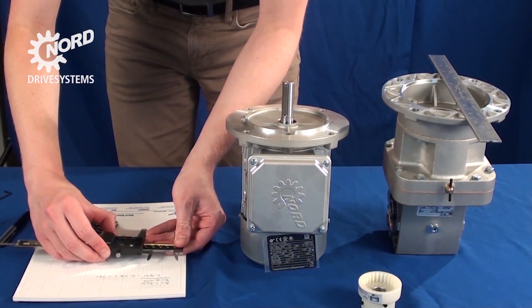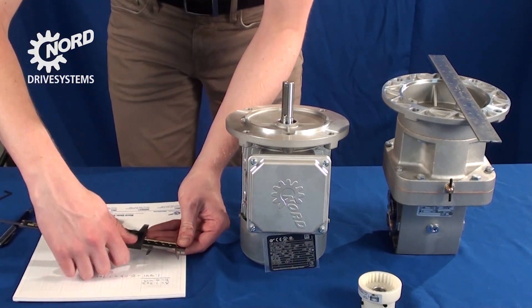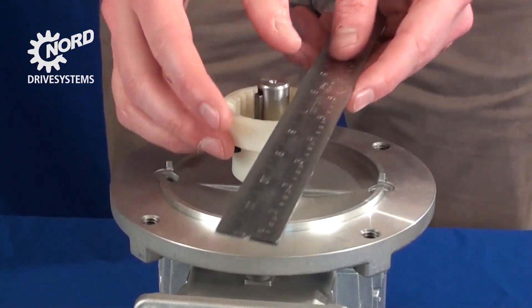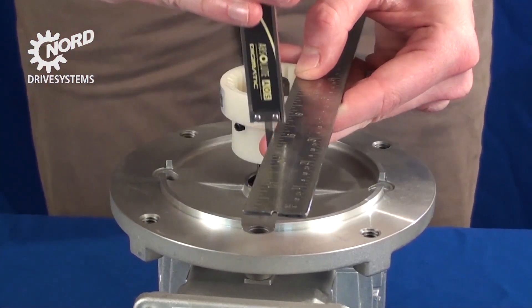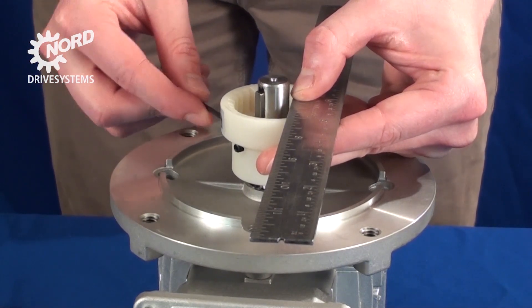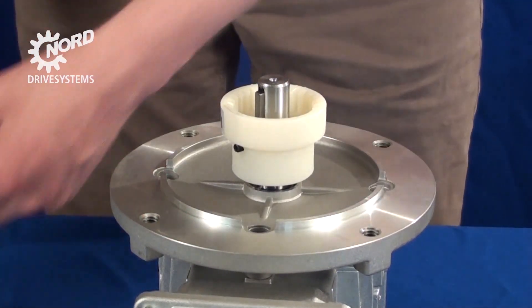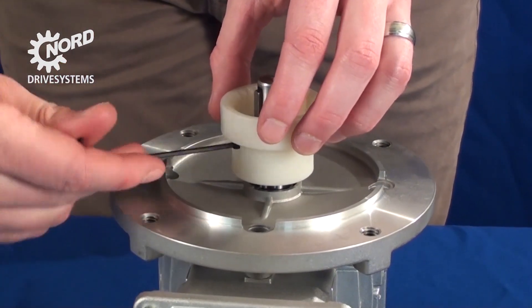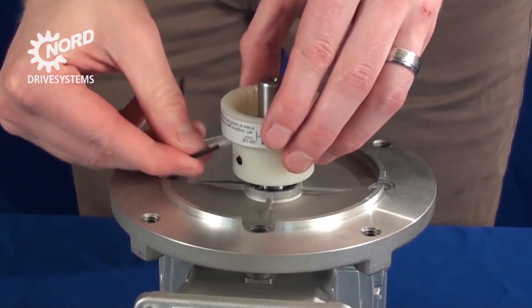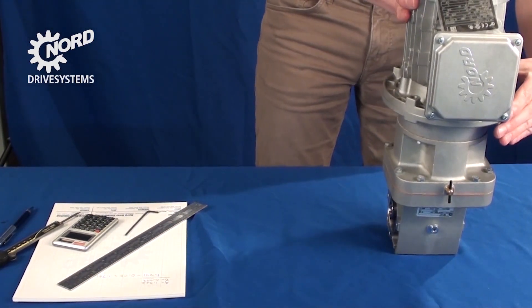Use the resulting measurement to locate the coupling from the face of the motor onto the rotor shaft. Once in place, tighten the set screw to lock the coupling in place. It is recommended that the key is staked or bonded in place to prohibit the key from vibrating out. Follow the instructions to mount the motor on the input adapter with the customer supply bolts.